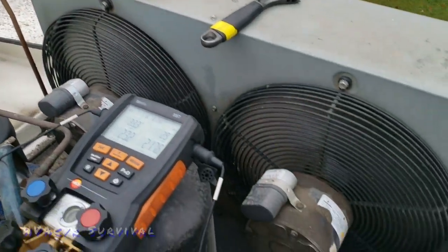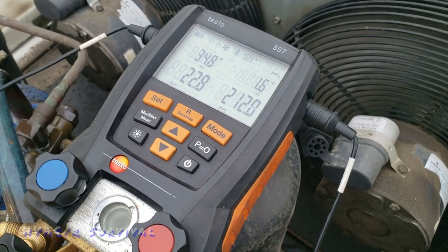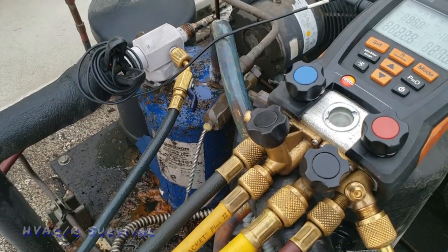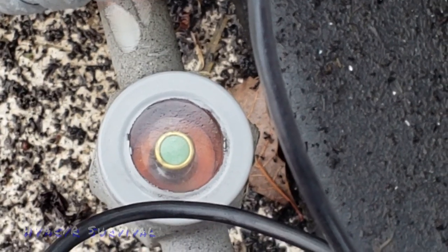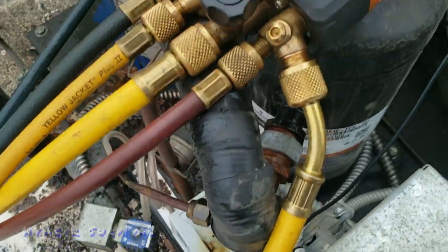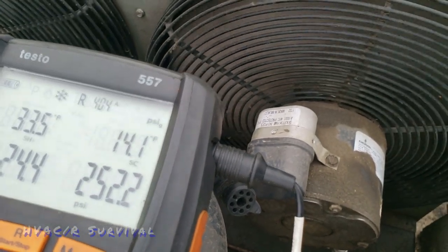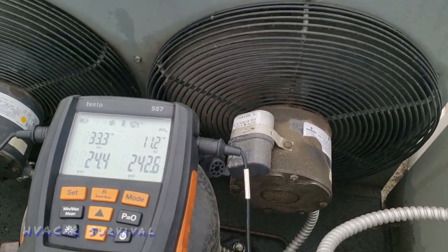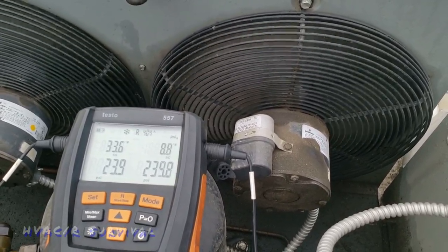When you come from the air conditioning world you think about sub-cooling, but because we've got the receiver and all the cooling factors going on, your sub-cooling is generally pretty low - you can't go by that. Everything's based off superheat. It appears to be holding steady but we're going to watch it a bit, because generally about when you think you're there it will change and start showing bubbles again. As the fan shuts off and cools it down, sub-cooling drops, which means you start pulling in liquid.